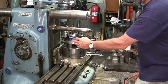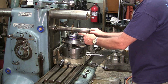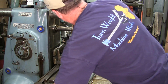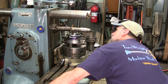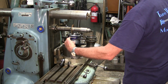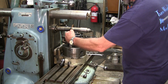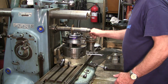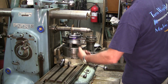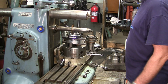I'm coming out here and I'm trying to take the width of the area I'm going to cut and place it underneath the bottom of that cutter. That way I know when the cutting teeth are going this way, they're only pushing sideways. If you were to get way on this side, it would be on the uphill, and then you would be wanting to lift that part with your tool pressure. And if you were on the other side, then you'd be wanting to dive down.